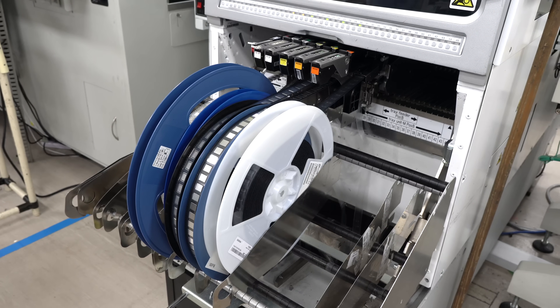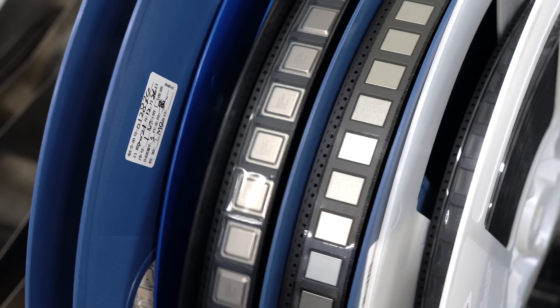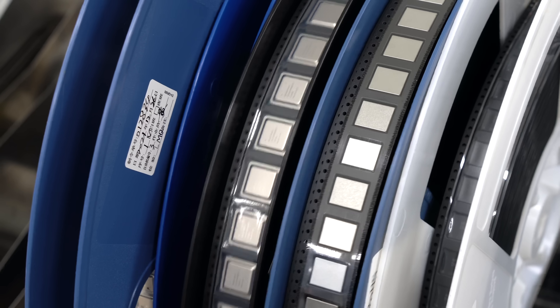Because of that, they have to put the shorter components down first, then the larger ones — otherwise the tools would obliterate the larger components while spinning around. So the initial key is: smaller components on the underside of the board get done first, then the larger components on the top side, done last.